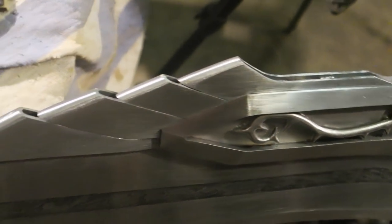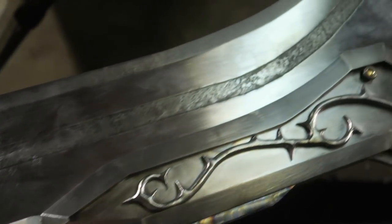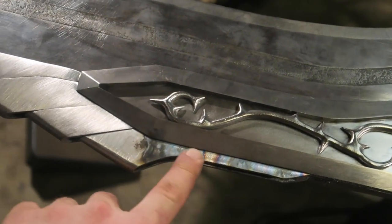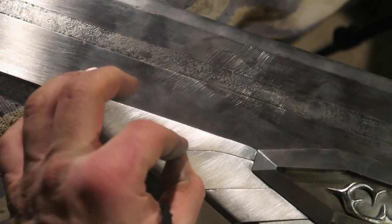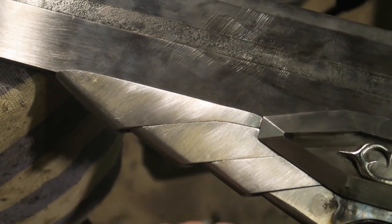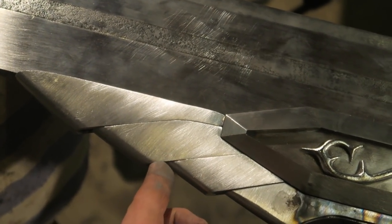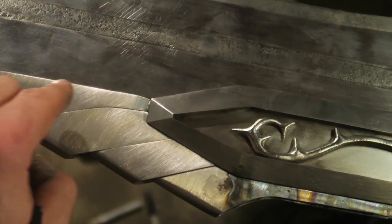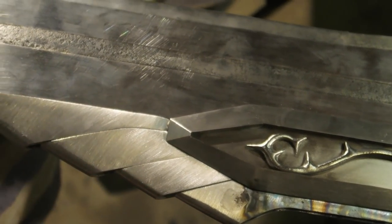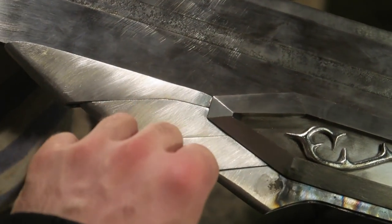Yeah, so hopefully that'll be easier to clean up than the side that had the hole blasted through it. There we go. At least knowing that there's a hole blasted through it lets you know that it was a strongish weld. That'd be the other thing, if all these little delicate welds that we're doing weren't actually strong enough. They probably aren't that strong, but the fact that a lot of them were welded in different places, like two tack welds done as a thing takes a corner, zap zap, is like infinitely stronger than if it was just on a flat, because something could grab and tear up.